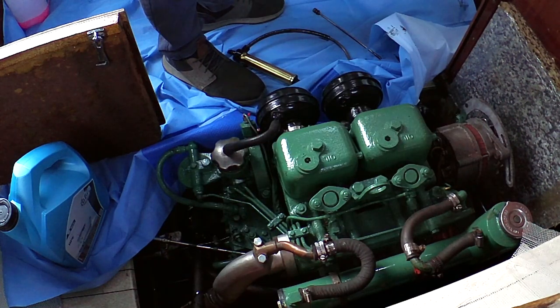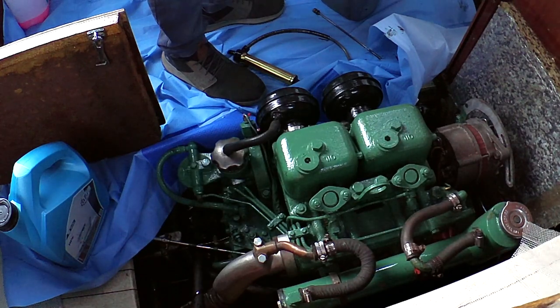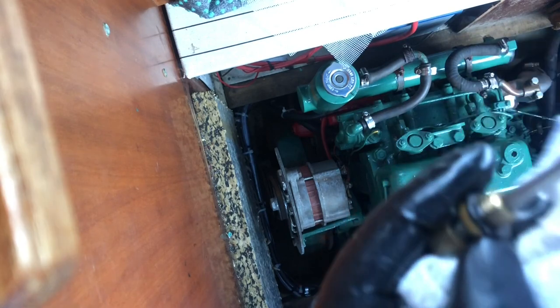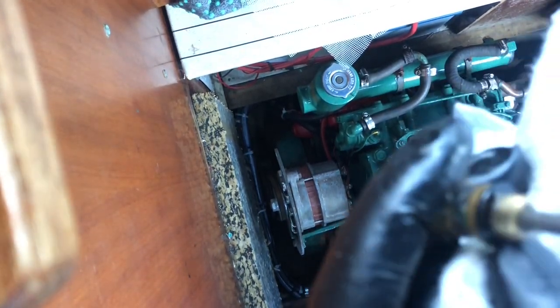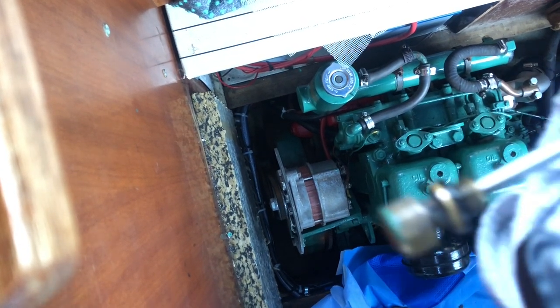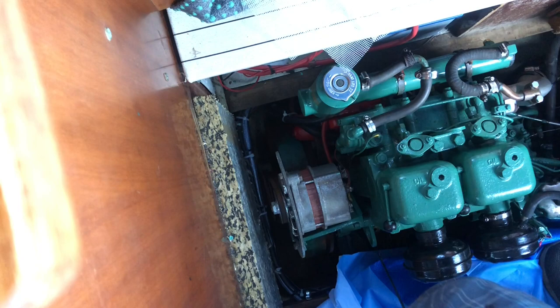Yeah, I think I got it all. This is a 4-liter container, and yeah, looks to be right around 2.8, including the filter. So let's see, it's good. This also has a little O-ring on it, well, I think actually it is some kind of fiber washer, maybe. Be careful, do not lose that one. Nothing on the dipstick. I think we're okay.